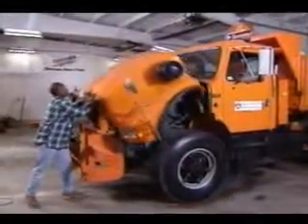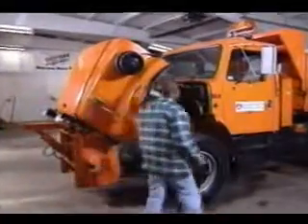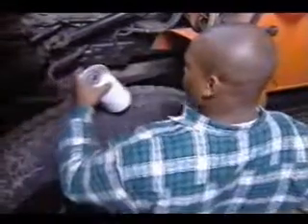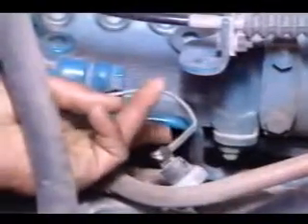Now it's time to get under the hood to make sure the engine is ready to meet the rigors of the upcoming snow removal season. Fuel filters should always be changed at the beginning of the season. Also, check for water in the fuel water separator and drain any water that is visible. At the same time, look for any fuel leaks — check for evidence of leaking fuel along the fuel line and on the garage floor. You can, of course, identify fuel by its smell.